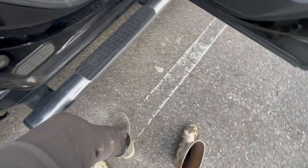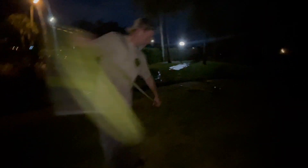We are almost done with this job. Just put down the Sikaflex on the channel drain edge here, so no water seeps in between the cut slab and the channel drain itself. Looks real clean. Sealed these edges as well. Got great slope, backfilled all the way. It's dark now. Big man Joe packing up the hose. Sod's all back on — coming out to the pop-up.